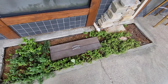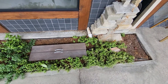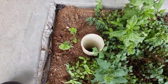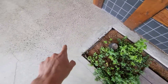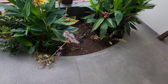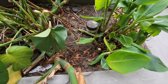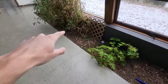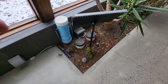This house has three different cells for the gray water planter. This first one is the reception cell — all the water from the bathroom comes in and fills this cell up. There's an observation tube where you can see the water level. The water flows under the concrete and over to the next cell, and then into the biggest cell at the end of the planter. You can see two observation tubes as well as a filter at the far end.